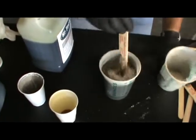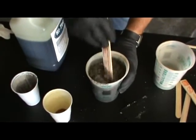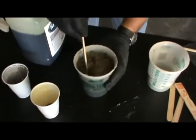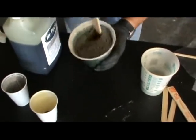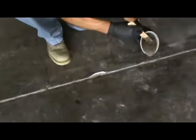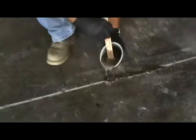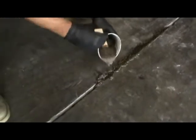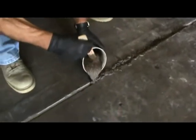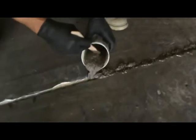So I've got a combination here. As you can see, I add a lot of sand to make it nice and thick. This really helps increase the compressive strength and makes the product very controllable — it doesn't run away from you. It also makes it a lot cheaper because sand is a very cheap filler. Now that I've got it blended for about 25 seconds, I'm going to come over to this large joint and start pouring this in. I follow along the joint we've opened up, keep stirring it a little bit to make sure I don't get too much settlement. Then I'm going to take a plastic spatula and strike it off.